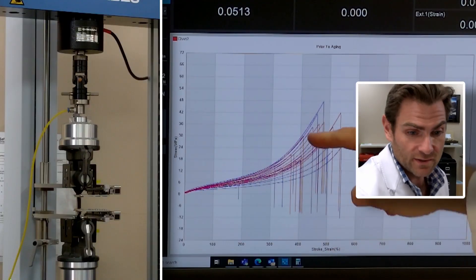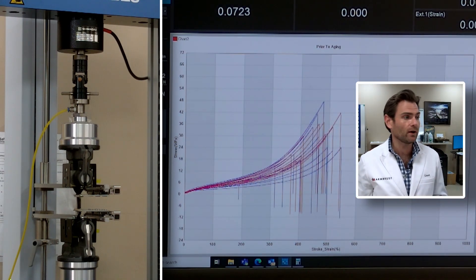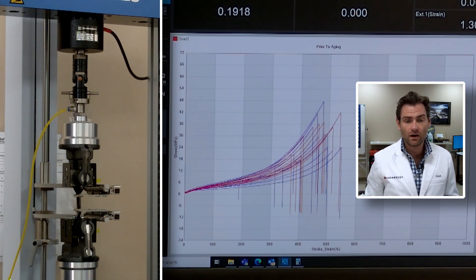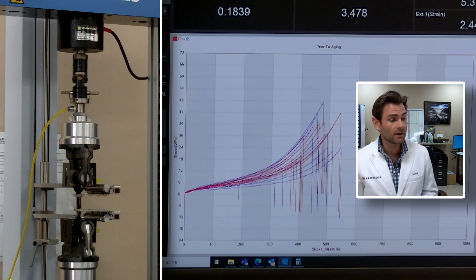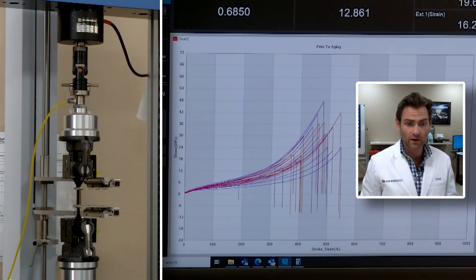We are doing an elongation and tensile strength test. What we're gonna do is stretch this glove until it breaks. You see these lines dropping right here? That's the glove breaking point. It's how far we can stretch it. With a normal glove we want to see 500% — we've only seen three of those in our test lot so far. This is an old glove, so we'll give it the benefit of that. It only needs to meet 400 to 500%.